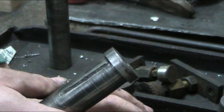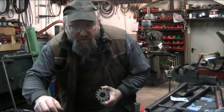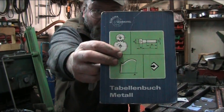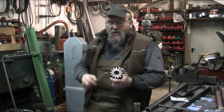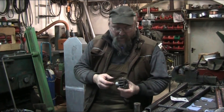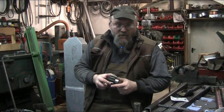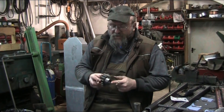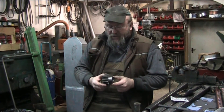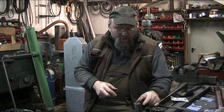After checking the book with the formula for figuring out the spacing on the teeth, this turns out to be an M6 tooth spacing, so we'll get a set of cutters and probably make the new center gear — the one that got busted. This one here is looking pretty worn along the teeth as well, but I'm going to throw it back together to get the machine working with these gears as-is. The machine is going to get a set of helical gears somewhere down the line. These pins are definitely going to get made new.